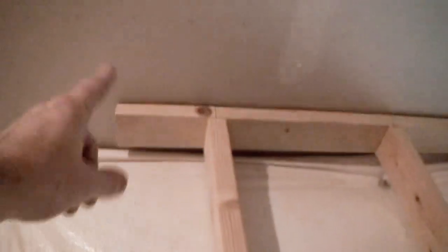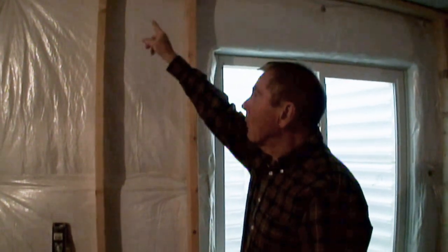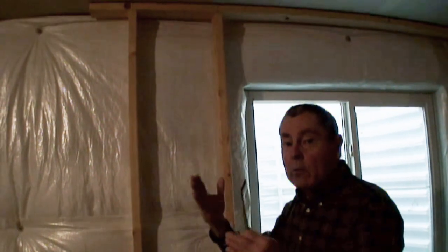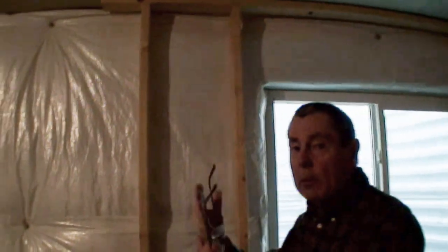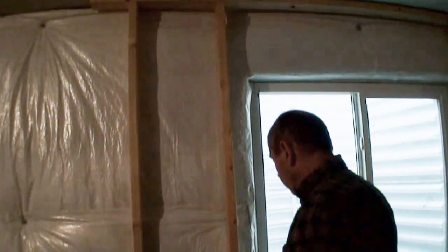Because the thing that's going to attach these anyway will be the screws going up into the joist through there. Correct. That's what holds them in place up at the top. The nails on the bottom. They're not attached to each other at all. Gotcha. What I generally do is when I'm all done, I'll take a piece of 2x4, 14½ inches, put it in there and screw it up into two of them, so that it kind of locks two of them in the same spot. And you can nail them from the side. I mean, you can go crazy with it.